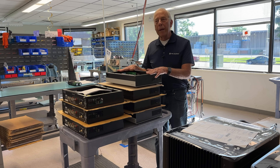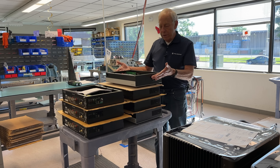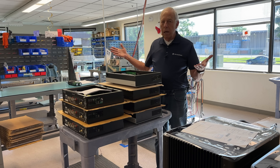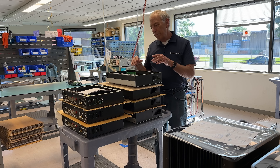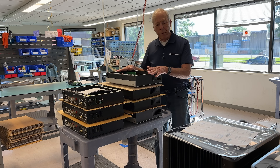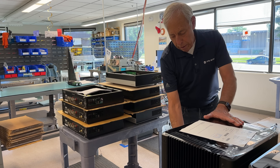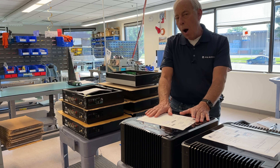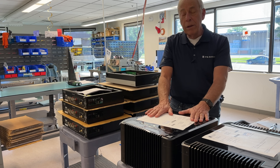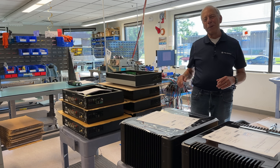I love this amp. I'm sure yours isn't Class D. And one way you can tell — put a meter on it to see, because this thing will draw a couple of watts, except for this Class A stage for the tube. But even that, it's not going to draw anywhere near what this beast over here will draw — 40 to 50 watts continuous — because it's a true Class AB amplifier. So I hope that helps. Thanks for the question.